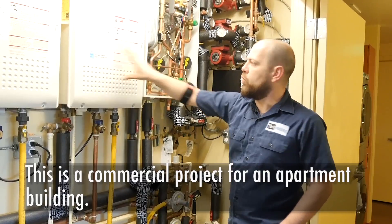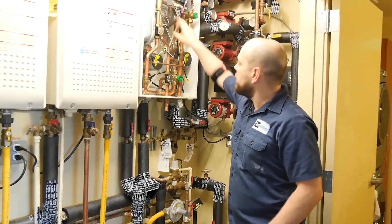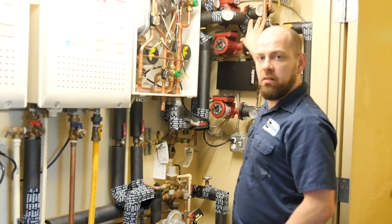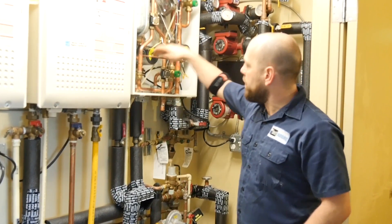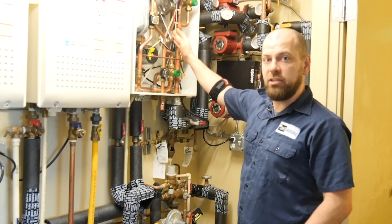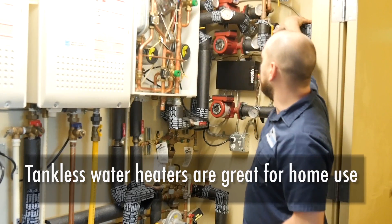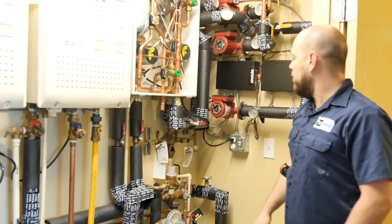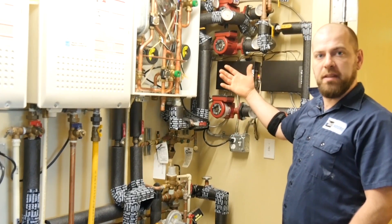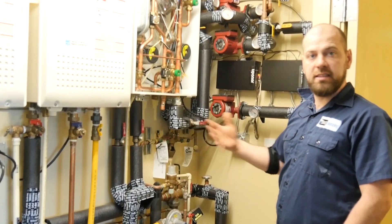In the heating box there are two pumps. One pump pulls water from these units and runs it through these heat exchangers, which separate the domestic water from the heating water. When this pump is running, the other pump is also running, pulling from the other side of the heat exchangers, scrubbing off BTUs and putting them into the heating system. Right now we're only getting 100 degrees, and it's probably in the mid-30s outside — we're not getting enough heat.